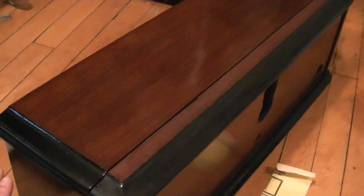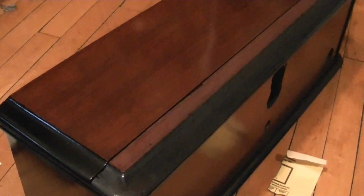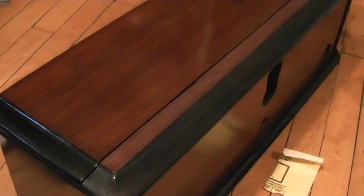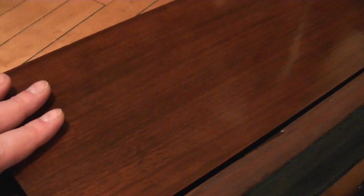Now as for the cabinet, it's been weeks since I did the initial refinishing pass, so the lacquer's nice and hard. Yesterday I gave this top panel a light sanding with 400 grit and sprayed on a couple more coats of clear lacquer. Quite smooth now. I'll let that set up for a few more weeks and I'll do a final rub out on that.